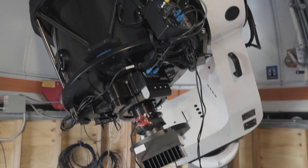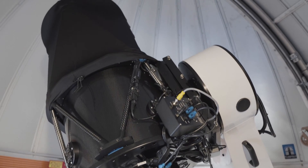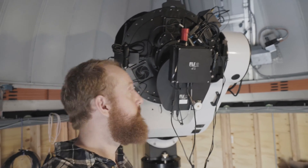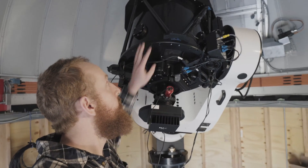We have the accessories on the telescope. We've cable routed everything — it's zip tied, secured, checked the range of motion — then we went ahead and balanced the declination axis and the right ascension. When we move the telescope and point it, it's just going to stay stationary. When we say balancing a direct drive, that's what we mean at PlaneWave, because that's going to allow us to perform a high-quality tune on the motors and yield high-precision tracking around 0.05 to 0.15 arcseconds.